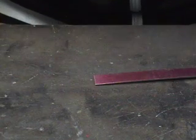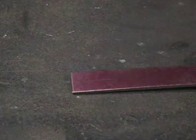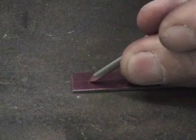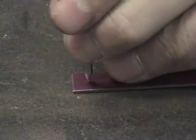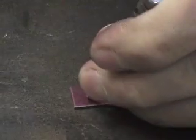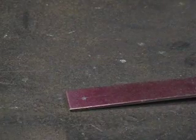Now that I have marked the location where the intersection of the two lines is for the hole, I'm going to put a center punch mark there. Notice how I'm tilting it at the edge because I can precisely place my point at the intersection of those two lines. Lift it up, put it straight up and down. If it's not quite in the right location, I'm going to put it in that mark again and bang it at a slight angle — that should move my mark over. When I'm happy, I'll just give it another tap, and that allows me to locate the position for the hole.